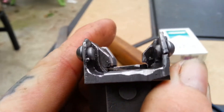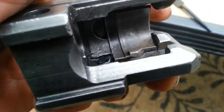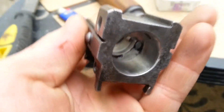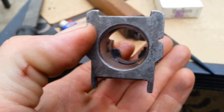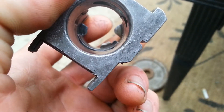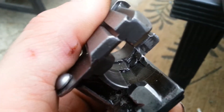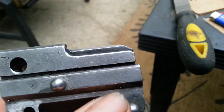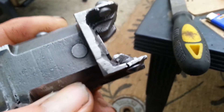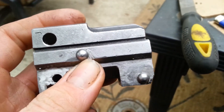That's what your rivets should look like inside — see that, nice and flat, and it clears the barrel. The barrel has to slide in there and not hit the rivet, so you have to make sure it doesn't interfere — same way on the other side. That rivet in the back is nice and flat. If you had the receiver on, you might not even know it cracked like that, and one day you're shooting and your stuff blows up in your face. Pay attention — my screw-ups can be your successes.